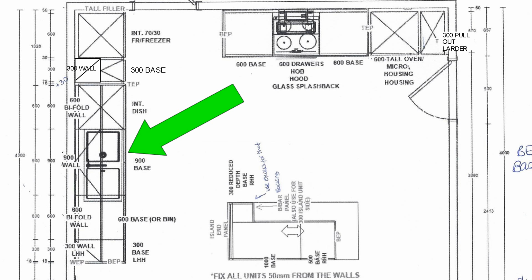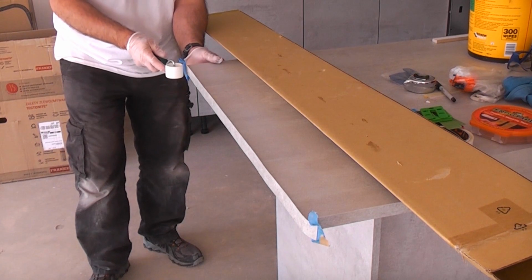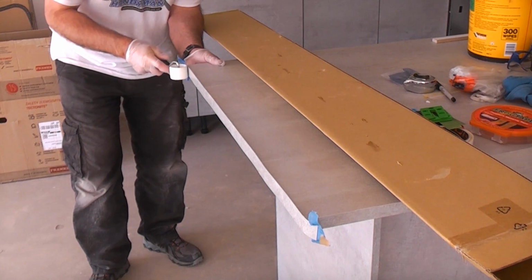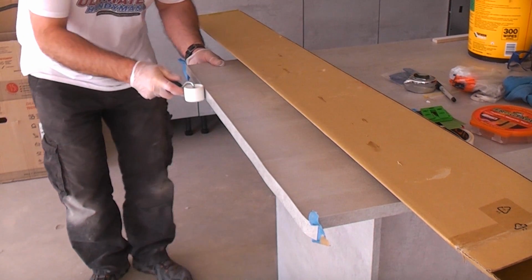This is noted on the plan here and is positioned over the 900mm base unit. The hob is positioned over the 600mm drawer unit. I have already cut the worktop to length and fitted the edging strip. This has been covered in other videos which I'll link to in the description.